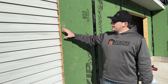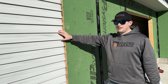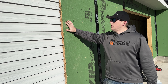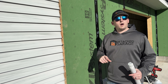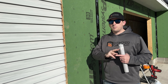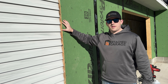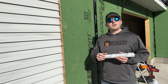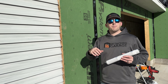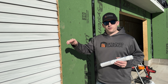We're going to talk about applying it between the old house, which was built in 1998 and doesn't have any house wrap on it, and the Huber Zip system. We're going to fill this gap right here to help with reducing air, draft, bugs, and potentially rodents as well. This gap filler can fill up to three-quarters of an inch gap — a pretty big gap. If you go bigger than that, you'll want to put some backing in there and then fill over the top.